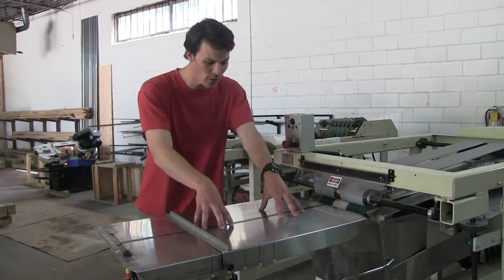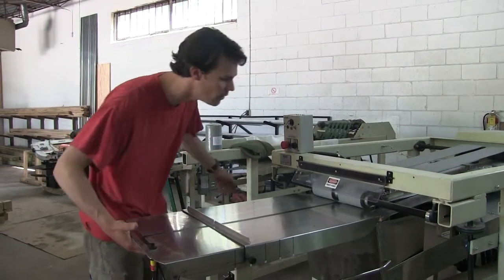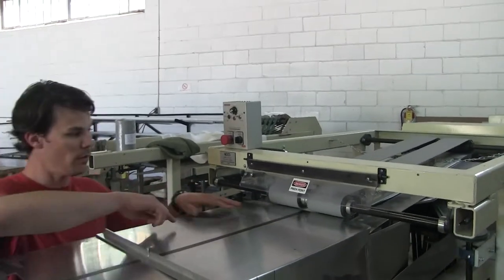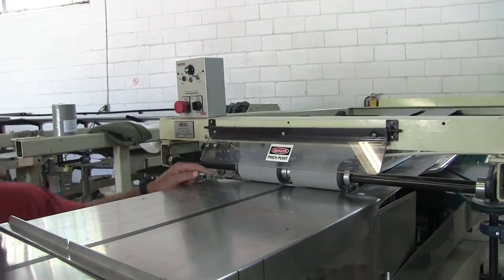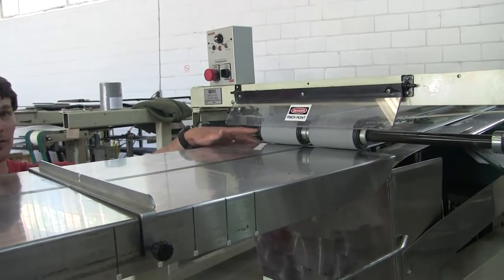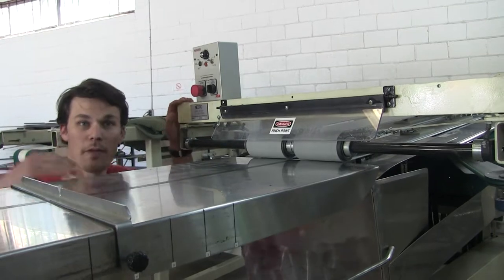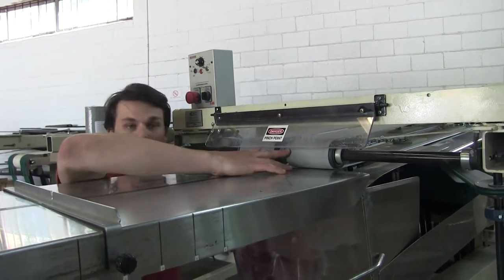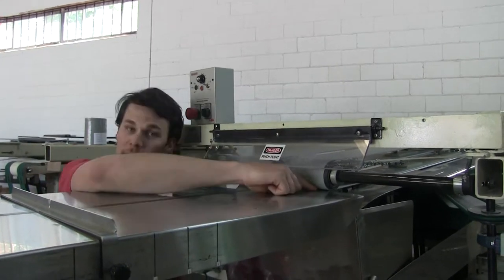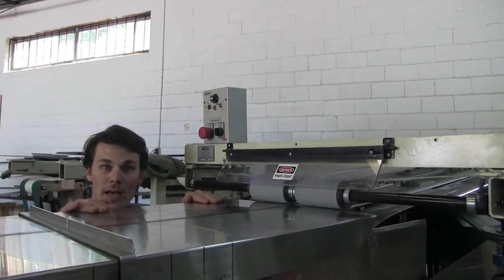This is the most important thing right here. Once we've done that, push the table all the way in and look at the gap — the gap between the stainless steel table and both of these rollers. I don't want these belts touching my stainless steel table because I'll chew these things up faster than needed. But I want them to come as close as possible, so when the table comes in, the shirt gets grabbed by these two rollers and starts working its way into the machine. I want this parallel to the table — the rollers and shaft parallel to my table working in unison.